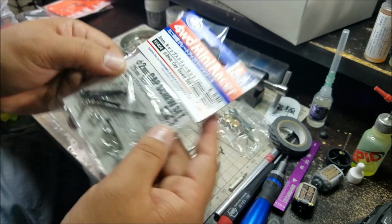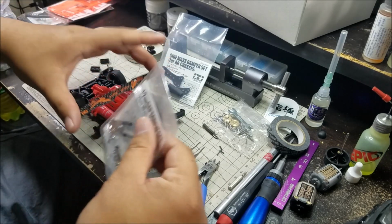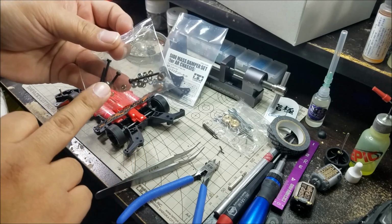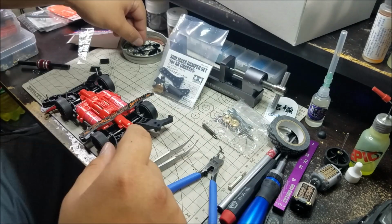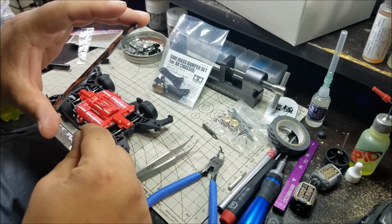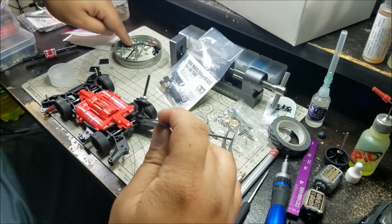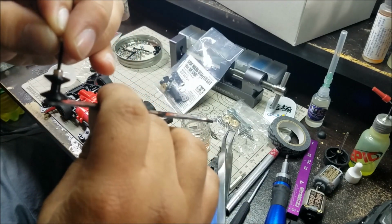That's where we're going to mount the 30mm bumper. I mean, basically the rollers are going to be mounted on the 30mm screw, and we're going to be using the lock nuts that are on the packaging. Alright, so 30mm right here. Okay, that's been mounted. We're gonna go get some 1.5mm spacer, put that there.